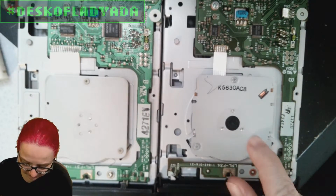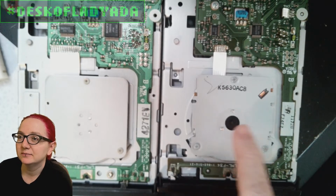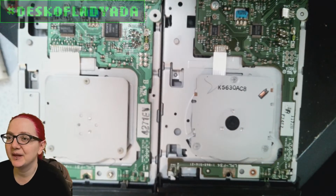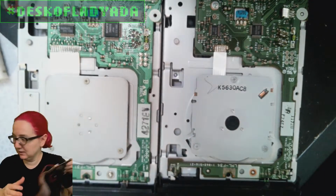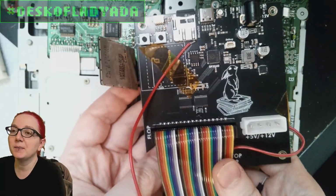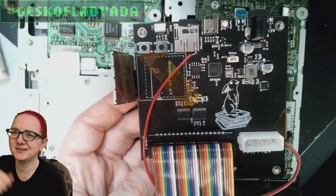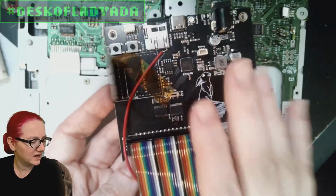And what's weird is I have two of these, and they're both not doing it. So it's something with this floppy drive. There's something I have to do to tell it, give me the index pulse. And my code for the RP2040 floppy board here, I'm coding it by hand, and I'm following floppy documentation. Whatever I'm doing, maybe I'm not setting some pin, or I have to gate enable something. It's not getting the index pulse.